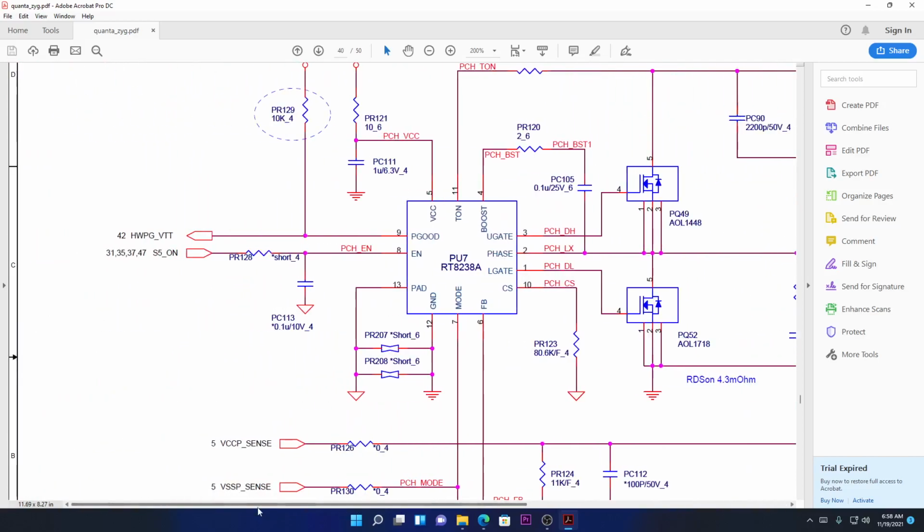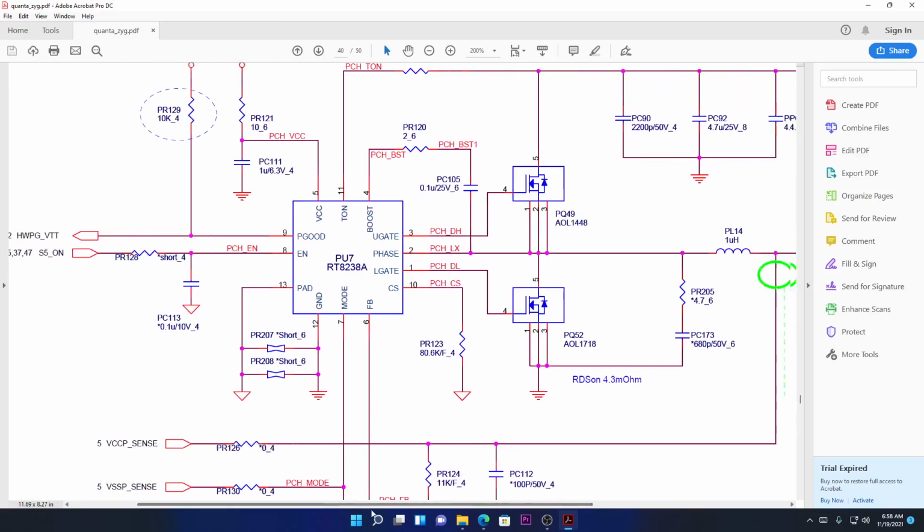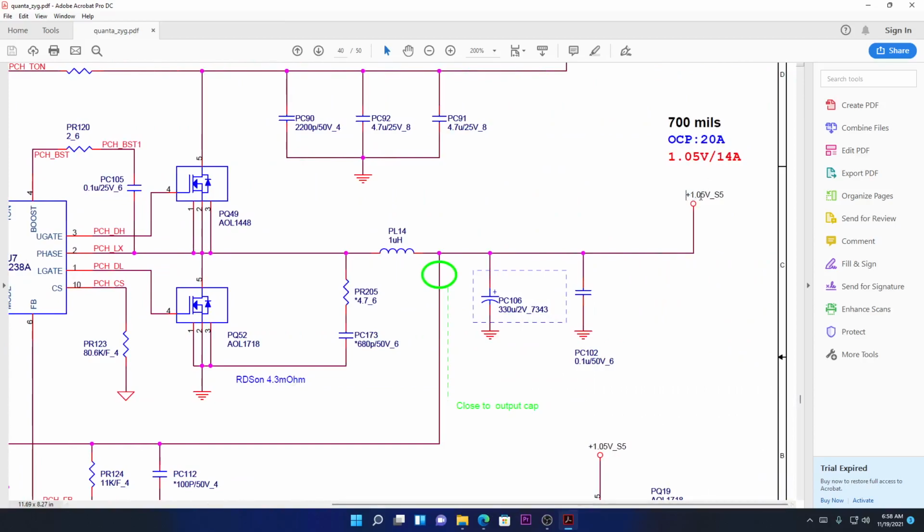But before I continue, I want to show you something. And again, this power rail here is so important. You should start taking this seriously, otherwise you'll have some issues. This 1.05 volts is so important. When you are missing this voltage, your laptop won't display at all, it won't boot up at all. Anyway, let me just stop right there.